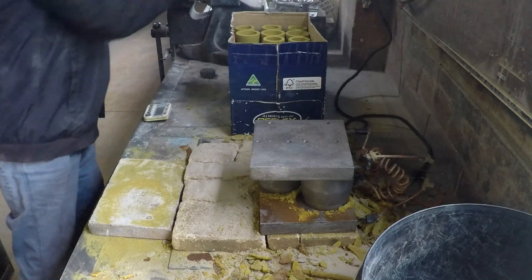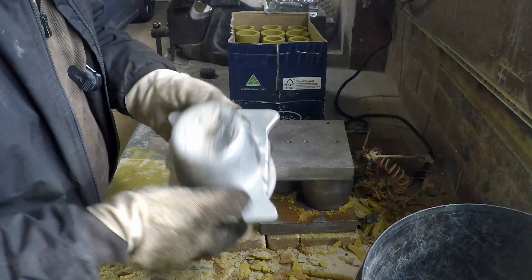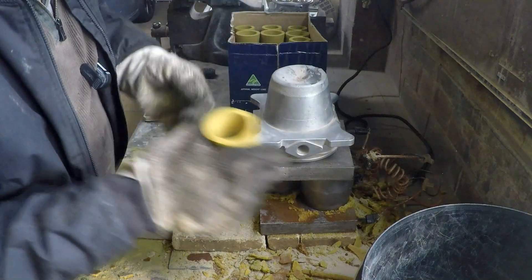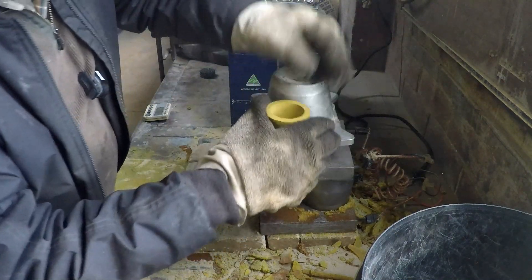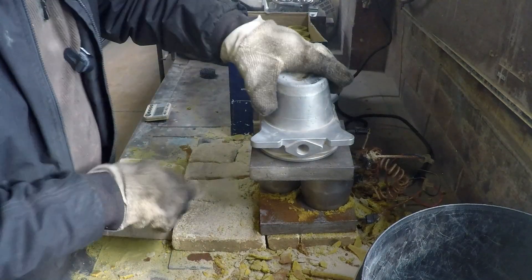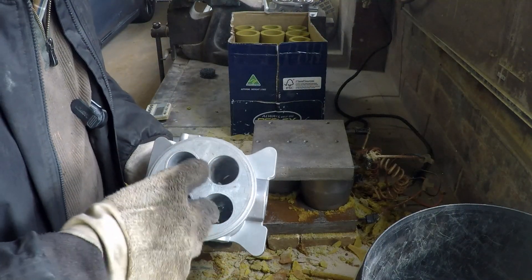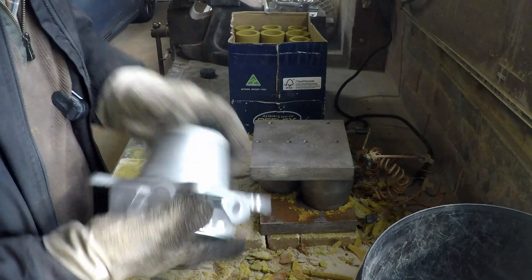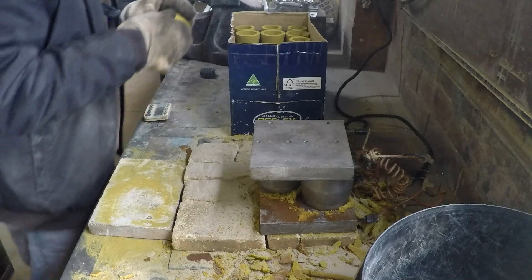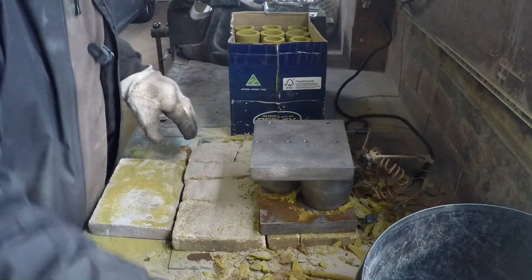I have now made a few hundred of these without any bubbles at all. This is the raw casting as I make it. The funnel actually sits about there with the filter just under it. The filter sits on top of the four metal cores that make up these holes. We'll see all that when we actually get to run the die a bit later — I'm sure it'll make a lot more sense at that time.